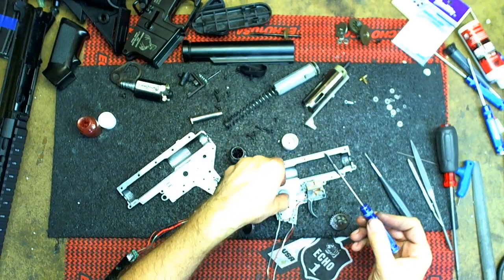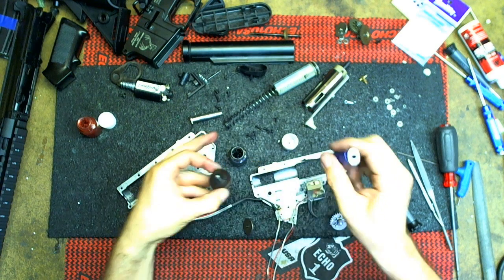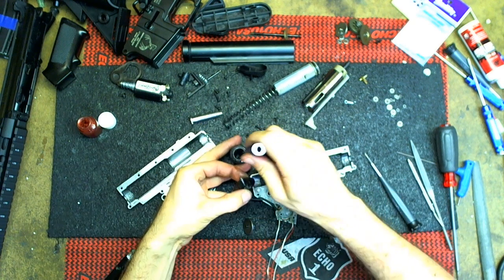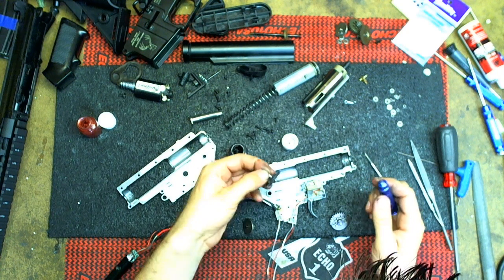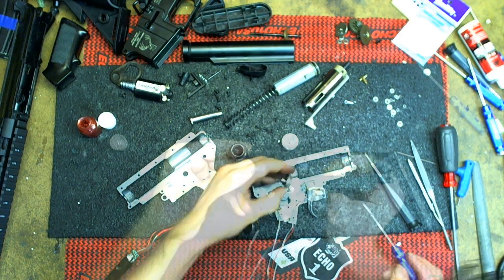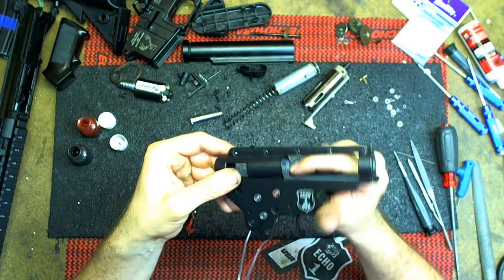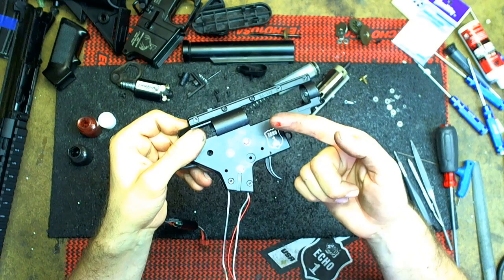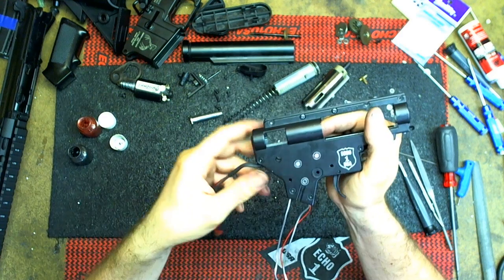You can put a generous portion on — it'll just get thrown off. But real quick for testing, I'll show you how if you have too much space or not enough space, the excess grease will get kind of thrown out of the way and kind of say, hey, you have too many shims there or not enough. Gears are now only making about three rotations or so — that's normal because there's extra grease in there bogging it down. Excess grease will come out. Once you plug in the motor and it spins real quick, all the excess will be removed.